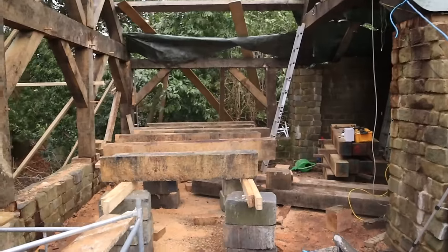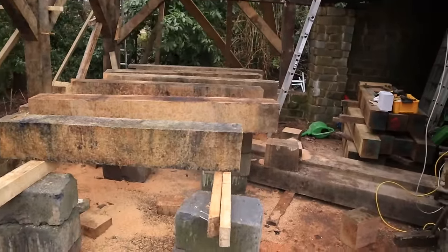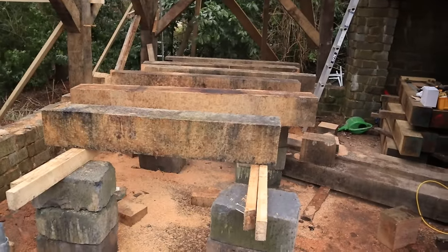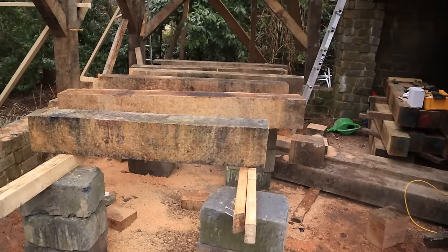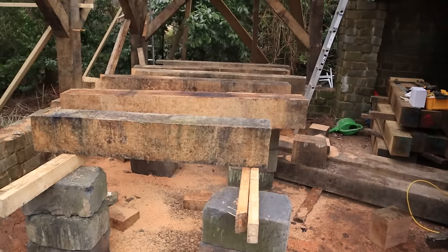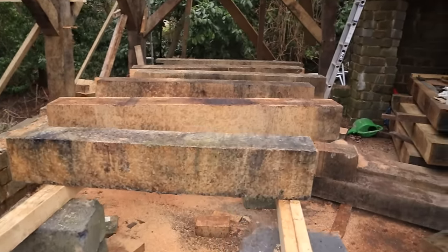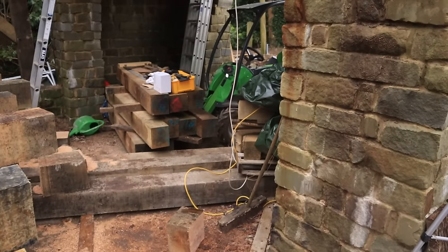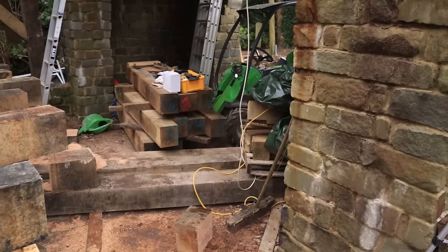Oh, just one more thing to say. Just to be clear, these legs are 100% finished. So they're trimmed, they've got the end section to go onto the beams, they've got the mortises done. And like last time, I thought, oh, I'll do the trimming later and all that. Total waste of time. So these now basically need to be stored. So what I'll do in the week is I'll swap these over for, well, I'll either do some more from here. I'm actually tempted to do the struts, which are stored outside at the minute, but I need to have a little look at the wood.